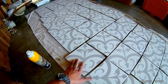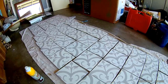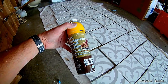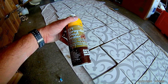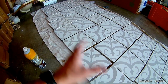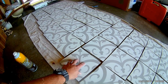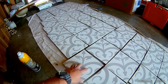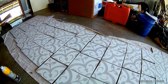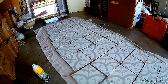We definitely recommend when installing cement tiles to lay everything out like this and seal it with any kind of sealer. We used 511 spray-on grout and tile sealer, oil base — we sprayed three coats on all of this before installation. Definitely seal prior to installation. Once you install the tile you can grout, and then seal the grout after that. Take a look at this quick installation video on Mastercrafted cement tile.